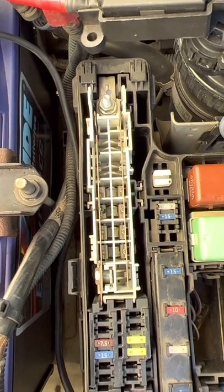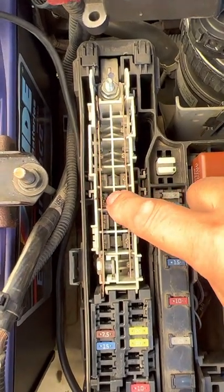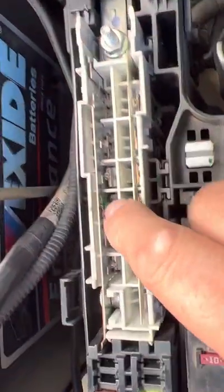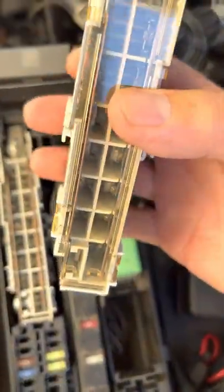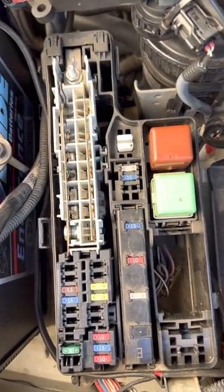This is just to get you started if you're stuck somewhere. If you don't have a soldering iron, you're out of luck, but at least you can narrow it down to this fuse. I've soldered a very thin wire from one end to the other — I had to use a magnifying glass because it's very difficult to get in at that angle. The original has a glass/plastic cover but as you can see there's not much room for soldering.